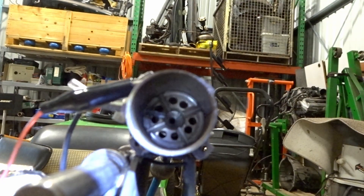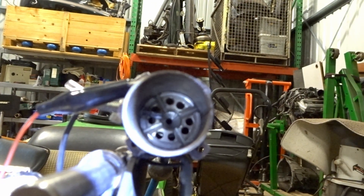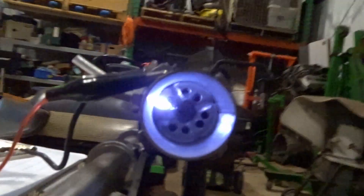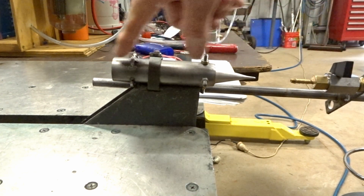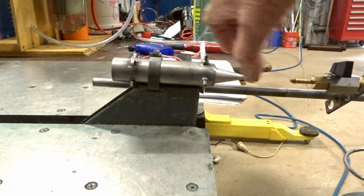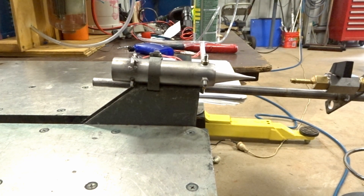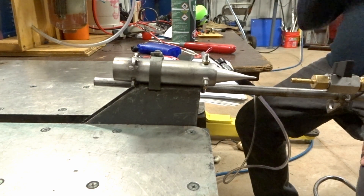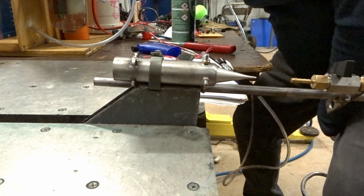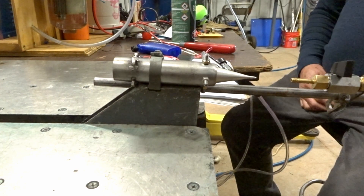This is my new flame holder diffuser — you can see the spark inside there as well. I've fitted the new diffuser and the spark injection there, so that's just in behind the diffuser. The gas will come in here as it was. This is an adjustable nozzle so I don't have to hold the torch blow gun on there, and that will be adjustable to give it more flow into the ramjet. We'll just set it up now and give it a try — just turned on, I'll turn the gas on and then the air on and see what sort of output we can get.